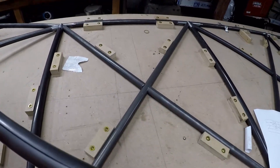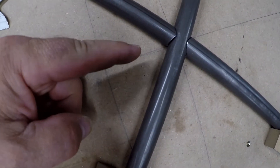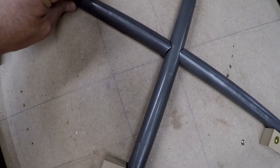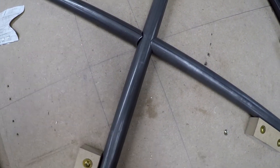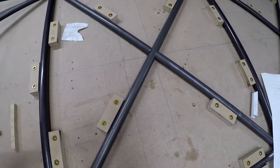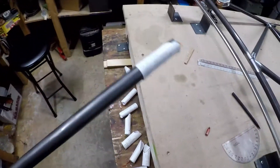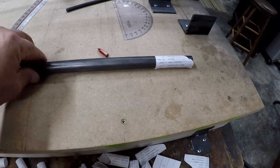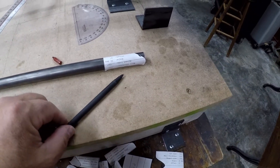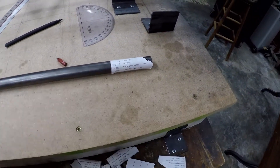This is a piece that I ended up cutting short — see the gap I have in this piece here. For a novice welder like myself I have a hard time bridging those kinds of gaps, so I'd like to have it really tight. Here's the piece that's going to go in there. What you end up doing is cleaning it off with a little bit of MEK, then resting it on a table and dragging a sharpie across both ends — making sure it doesn't move because you want those to be in line.